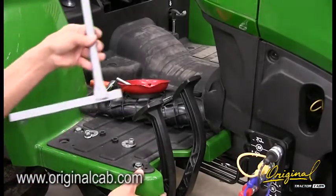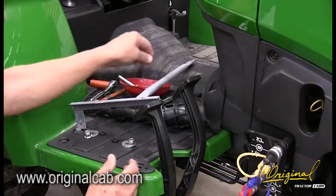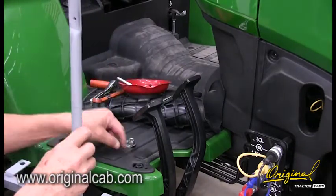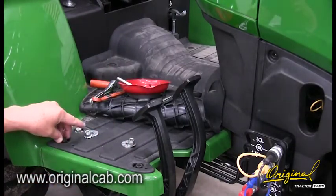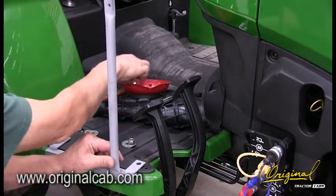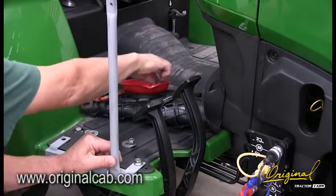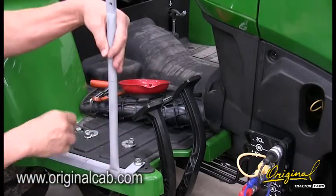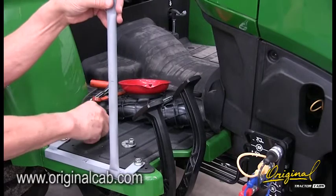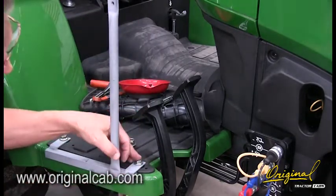Step 2, see figure 2. Install right and left feet 1 and 2 and foot pocket guards 3. A. Pull back the rubber mat on models so equipped. Remove the bolts at reference A. Place 2 5/8 by 1/4 inch spacers over the holes. Place a foot on the step plate as shown. Insert a 10mm by 70mm bolt down through the holes. Add the flat washers that were under the step plate and replace the removed nuts. Do not tighten at this time.